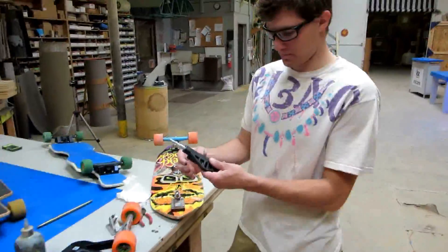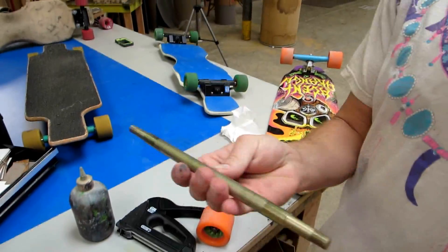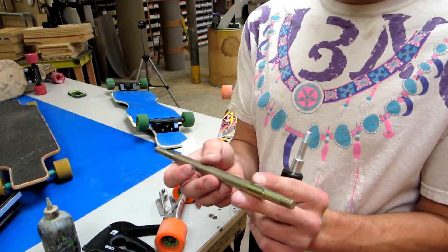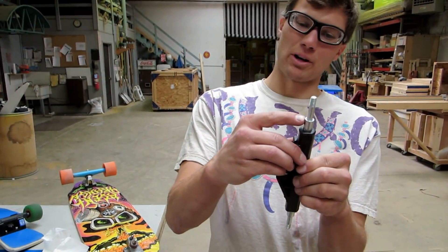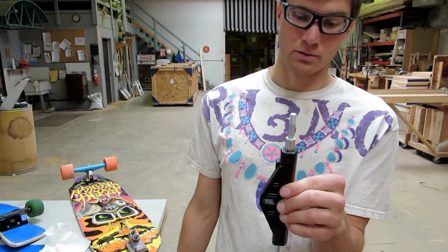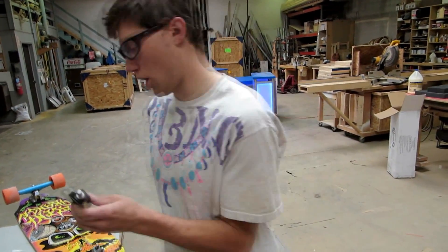The axle is the next key component. There's a glass-filled nylon hanger that's injection molded around the axle. The axle itself is pretty sweet — it is a half-inch diameter chromoly steel that's been hardened. On the 8mm axle version, that half-inch diameter comes almost all the way out to the end of the axle and then shoulders down to 8mm. So it maintains significant strength throughout the hanger due to the large mass of steel, making it a very strong skateboard truck.